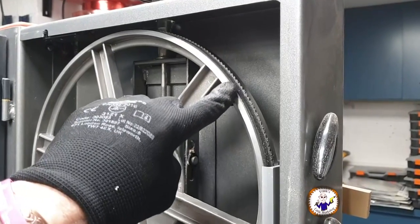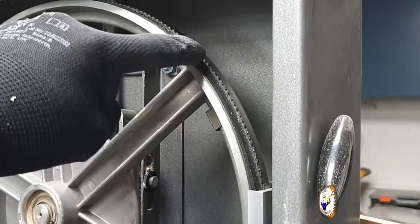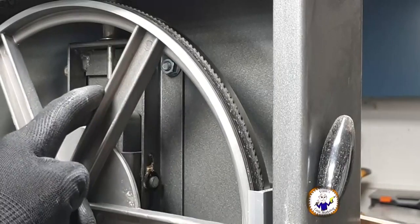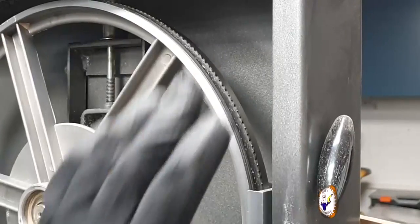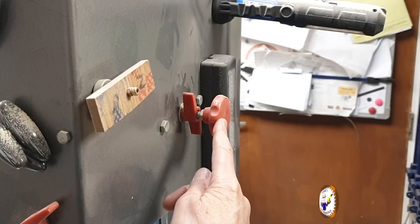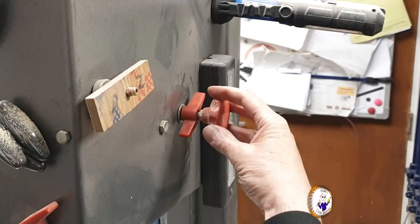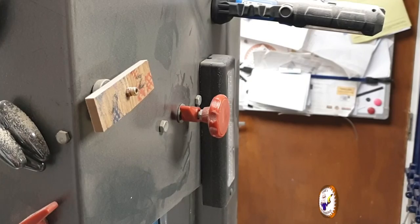What is tracking? On here you can see the blade is quite a way back on the wheel — on this black bit which is the tire. The teeth of the blade are quite far back. You can adjust that position using the tracking adjuster on the back of the machine. It's got a locking nut — undo the locking nut and then you turn the knob either clockwise or anti-clockwise.